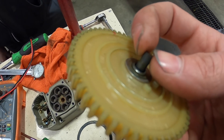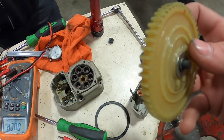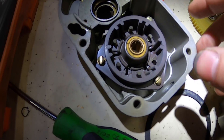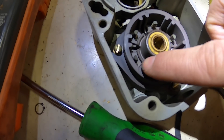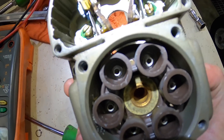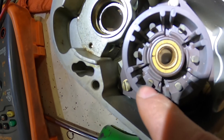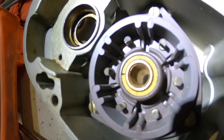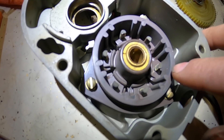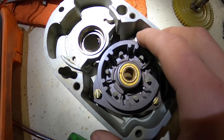We want to make sure the brush has even wear and that the spring is holding it in place properly — this part checks out fine. The third thing we're looking at is the block. We're making sure there's no cracks anywhere along the block on both sides, and that all these springs where your ignition leads go in look fine. We're checking the contact points for excessive wear — this one looks fine, just some small wear we'll file and sand out. This part also passes.